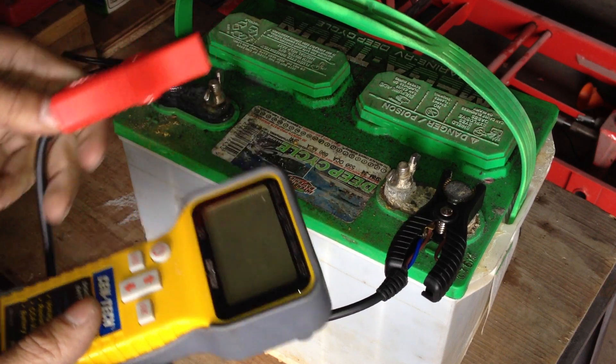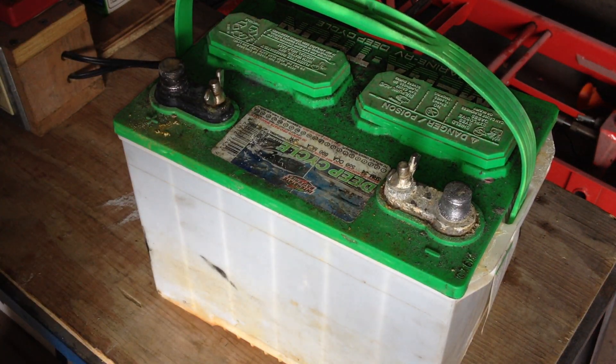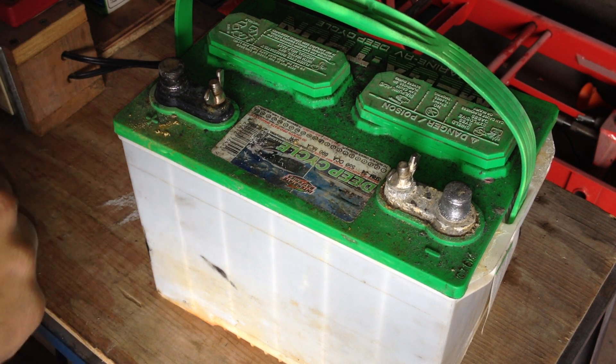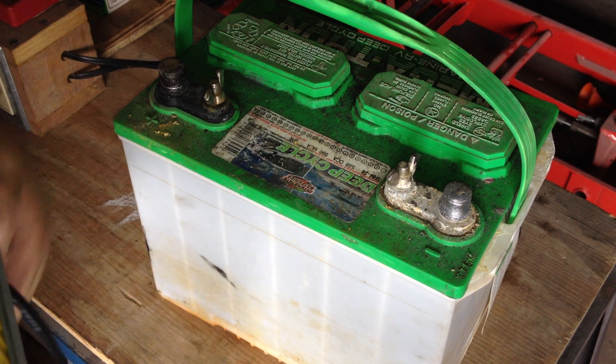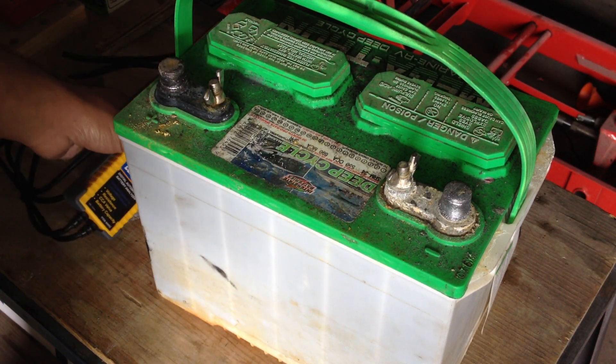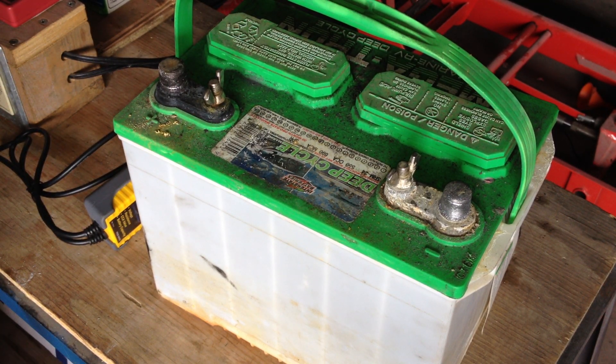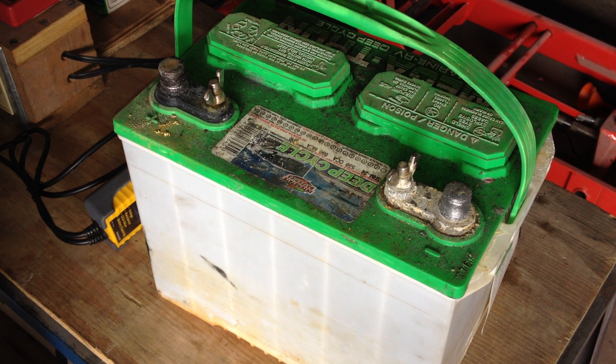I will admit that for this capacitive charger test, I only ran the charger for about 3 hours. Usually if I'm desulfating a battery I'll leave it on for 24 or 48 hours, or sometimes a month, depending on the battery size. I've done full forklift-sized batteries with these chargers — the real heavy-duty ones that weigh about 600 pounds that they put in forklifts — and I've run those for about a month on my system and brought them back to a fairly decent service life.